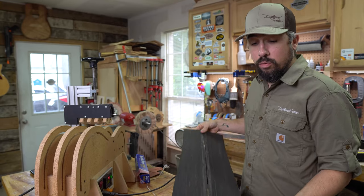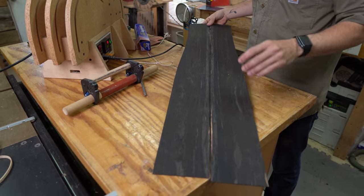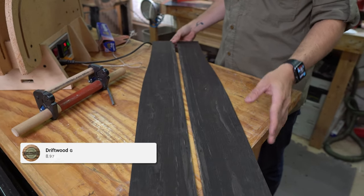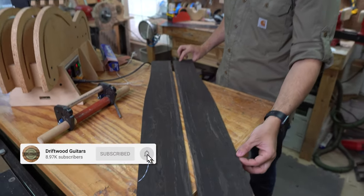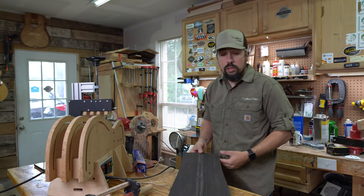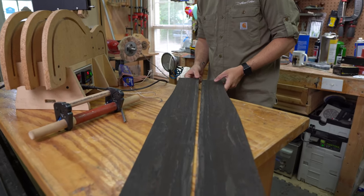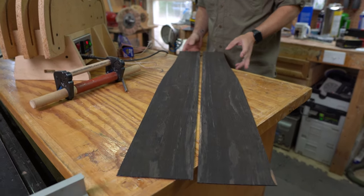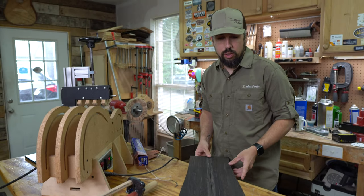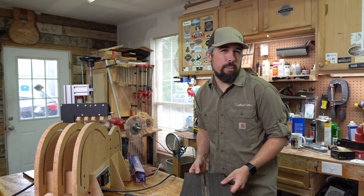We're actually going to be making this guitar out of this really awesome set of African ebony. It had a shellac on it and I just sanded that off — I'm super excited about the look. It's got these nice little patchy streaks so it's going to look great. I've run them through the drum sander in preparation for bending, taking them to about two and a quarter millimeters, which is about 90 thousandths for imperial users.